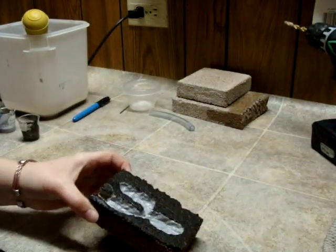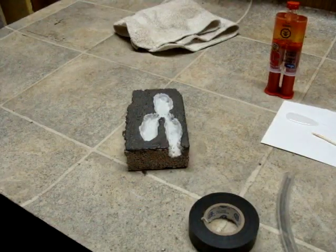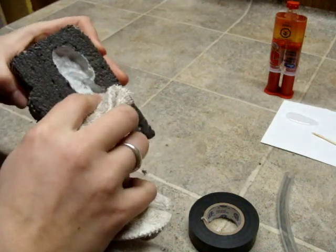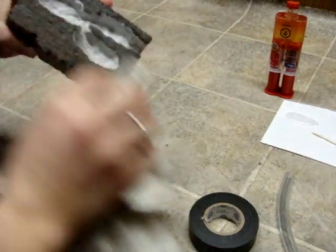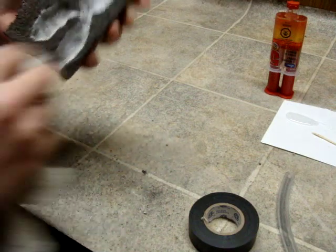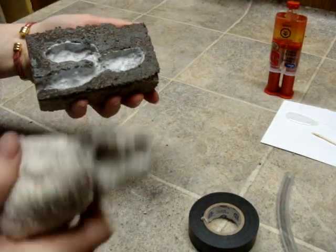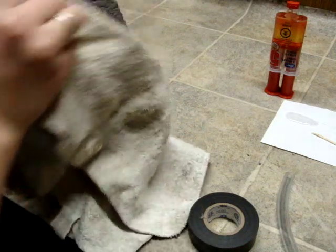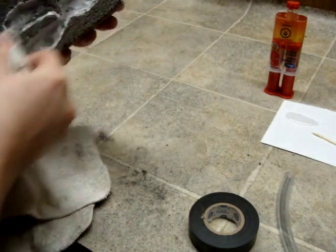The silicone can't adhere to straight dust. But all that extra grout will allow the color to sink in a lot better. Our grout is now dry, so we are going to brush off the excess grout. We are only going to do the stuff on the outside — we are not going to touch the tunnels. We are just doing the outside so that the silicone will bind to it later. Just give it a good brushing. Anything loose will interfere with the silicone or sealant later.